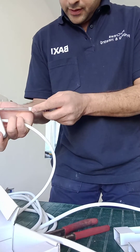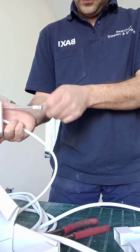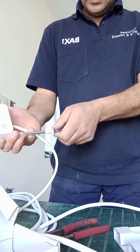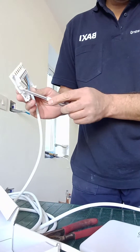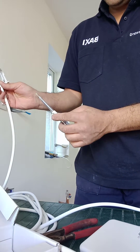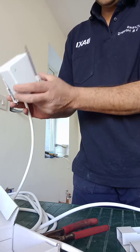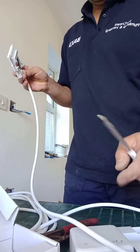Sorry, we have to go back — we have to screw the back wiring plate to the wall first. There are two screw holes here, to the right and to the left. Screw it somewhere above or to the side of the boiler, a bit away from it, and then the front body clips onto it. Then I'll show you how to wire the other end of the cable to the boiler.